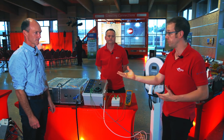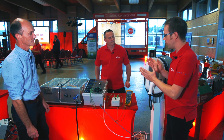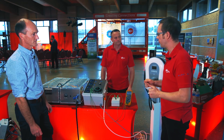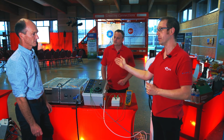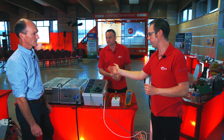Let's go on and look at the Zappi 2. You believe that you can show us how that will solve this problem, because we're not looking at the voltages — we're looking at a way of disconnecting in a different way. So we've simulated the fault, the very realistic fault discussed earlier. What we've seen is that under Amendment 1 to BS 7671, a device that meets the requirements of that regulation would not trip in the circumstances we've outlined here, which is very realistic.